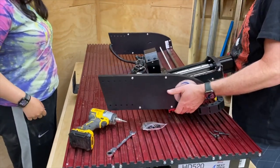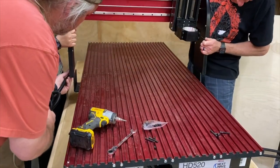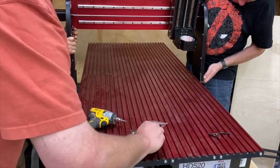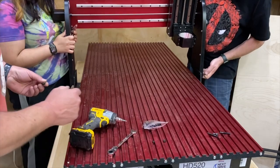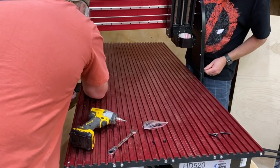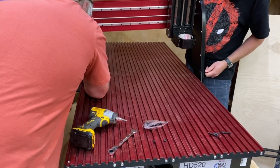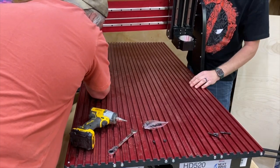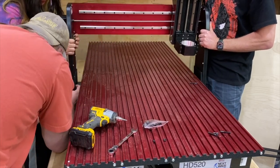You just need some help to get it set up, get the bolts in, and get the nuts on and tighten it down. Make sure you have the cable pulled to the outside of the machine — you don't want it pinched on the Y-spar, and you want it over there so running the cabling is easier. The tolerances on this thing are so tight that it's sometimes difficult to get the screws in and you may need a nut driver to push them through.